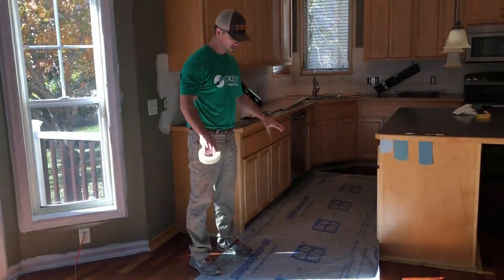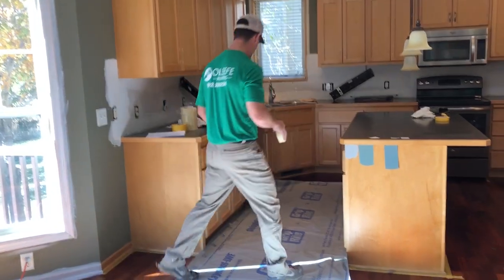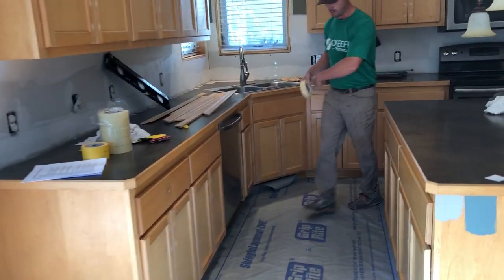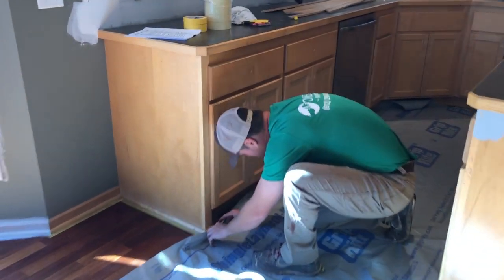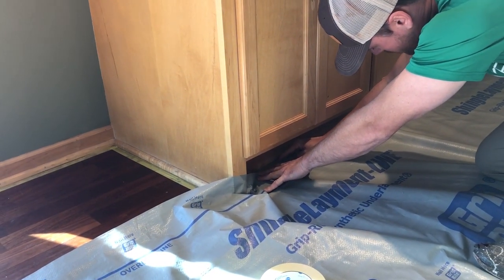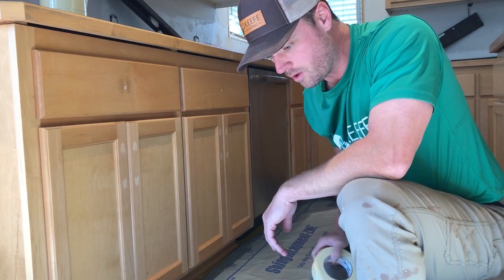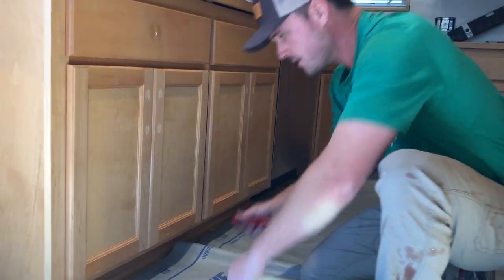We are laying down our Grip Right underlayment now. We're going to tack our inch-and-a-half inner tape on top of our yellow frog tape and get it extended as far as you can, fold that corner in underneath, and trim around this cabinet here. Ideally, the underlayment sits just on the edge so the inner tape is on top of both the underlayment and the yellow frog tape. This inner tape is not super high adhesion — nothing like 20-20 tape — but we'd like to not have it stick to a floor for too long because we don't know what the finish is like. The yellow frog tape is just a little bit safer for that.